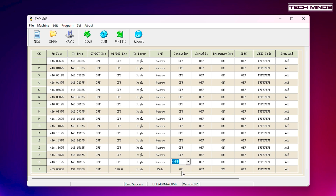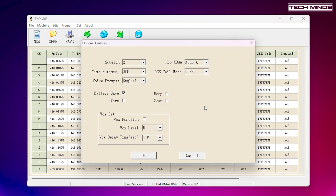I'll perform a memory read and then program in 15 of the UK PMR frequencies just for receive, as this radio would not be permitted to be used on the UK PMR band. Channel 16 I'll program to my local 70 centimeter repeater. Now with some frequencies programmed, let's see what I can hear on the PMR band — for this I'll connect to an external antenna.